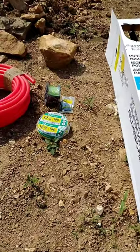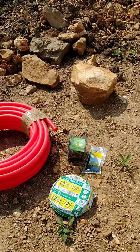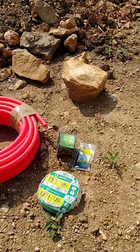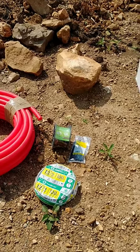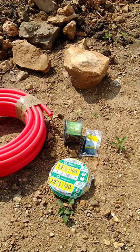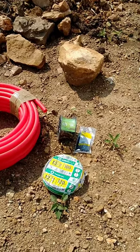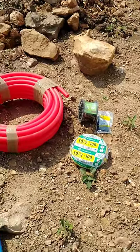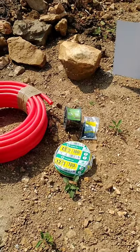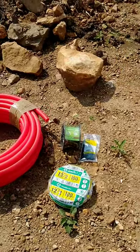The thermostat wire is, for right now, kind of an extra thing. It was pretty cheap. It was only $24. And so I'm going to go ahead and run it, even though right at the moment I don't plan on using it. There are some ways that things can be set up on these outdoor wood boilers so that the circulation pump only runs whenever there's a demand for heat. I'm not going to actually do that right now, but it could be set up that way in the future, and for $24, having the wire in there will be handy.